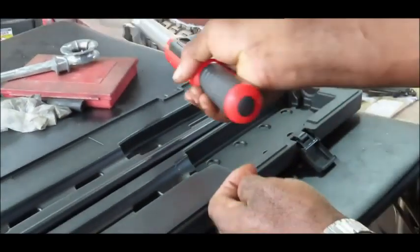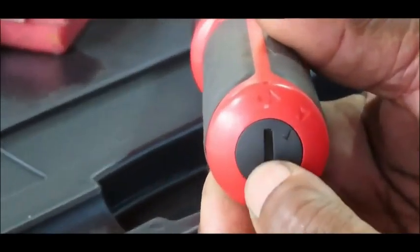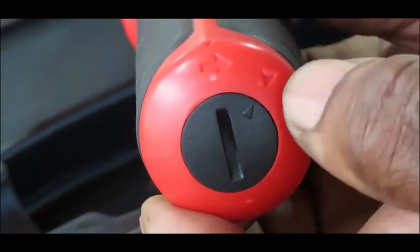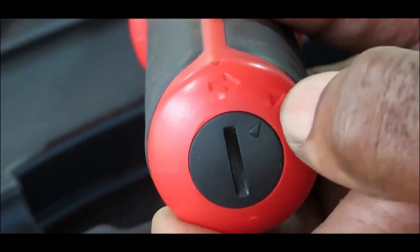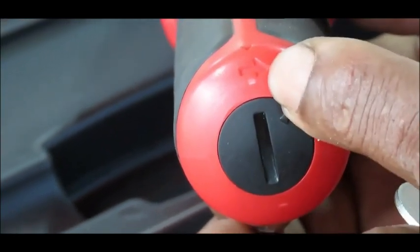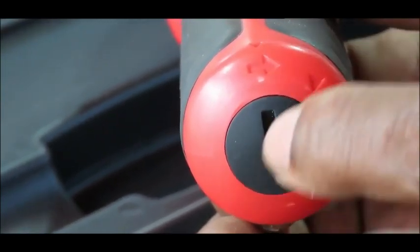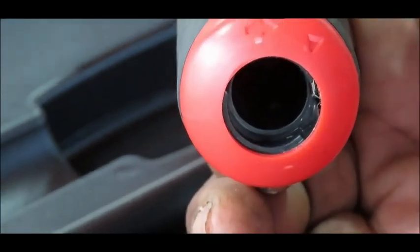What this coin is for: on the head, on the end of the ratchet, you're going to see this little opening right here. Pay close attention because there's going to be a triangle right here, a triangle right here, and an arrow over here. This is what you call the lock position. Take that tool, stick it into the slot, turn it counterclockwise — aligning it with that arrow — and this is going to start to pop out, just like that.